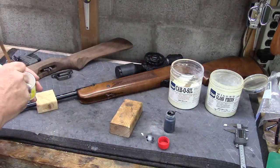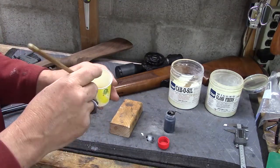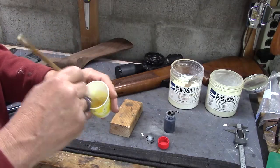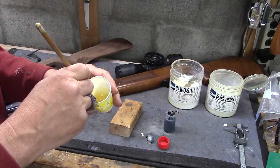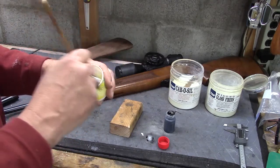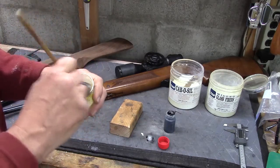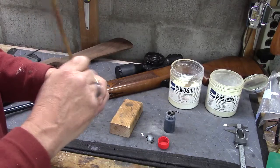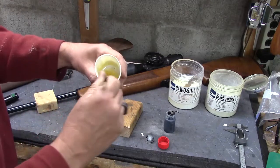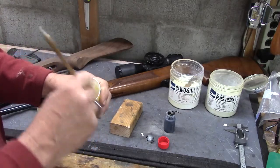Stir stick. So when mixing, don't use a wax paper cup because you'll scrape the wax off into the mixture, and of course wax doesn't stick to epoxy - anathema. If the stuff is cold, you can heat it up with a heat gun a little bit, but that will definitely decrease your working time. It should be about 60 seconds of mix, and you want to get the edges of the cup, all of the bottom of the cup, making sure all the resin and hardener is mixed together well.